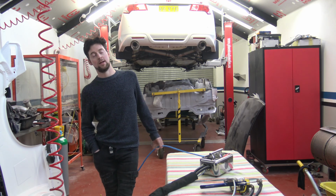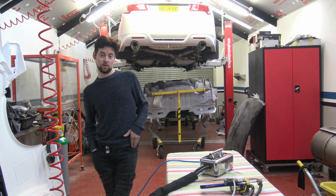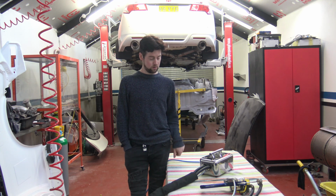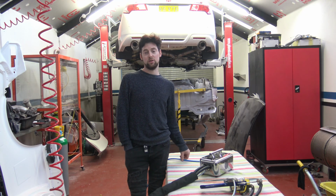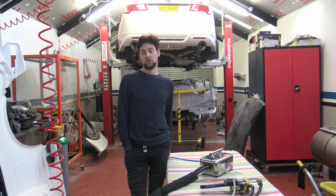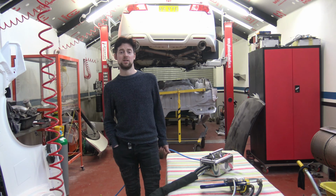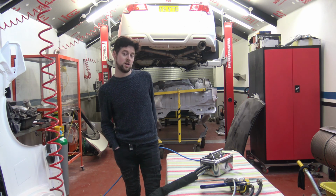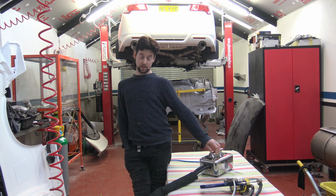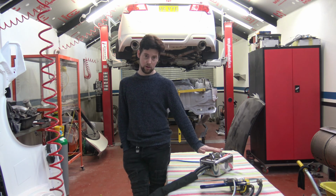So I have a lot to talk about, electrical, mechanical, pneumatics, and mathematical calculations for the transformer before I even go on to demo the spot welder welding. The project consists of a pneumatic clamp with a selected pneumatic piston with the correct stroke, and the correct pressure required for the pinch point and the clamp pressure. The system has a specially designed high current transformer that is housed in this handcrafted box. I'm going to take the whole lot in bits, so I'm going to take the enclosures off the spot welder and the transformer and show you inside.